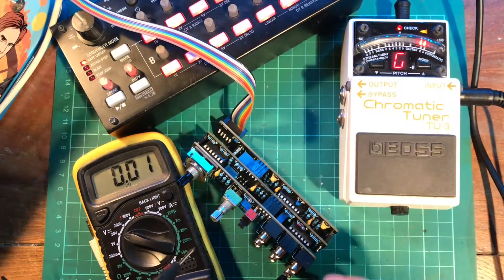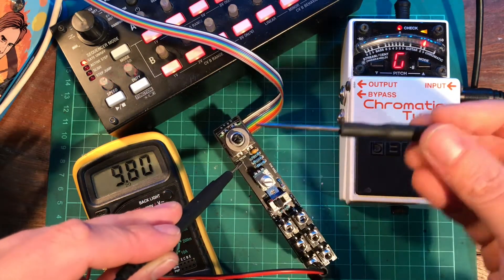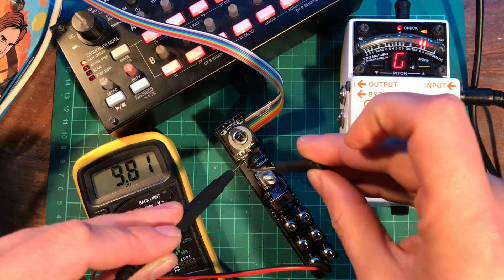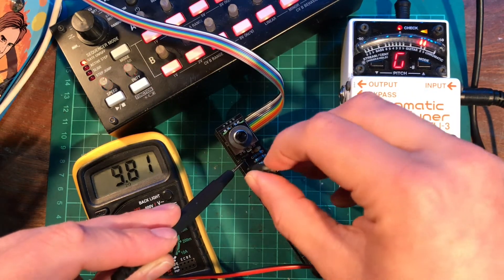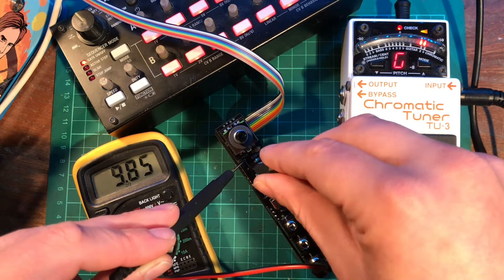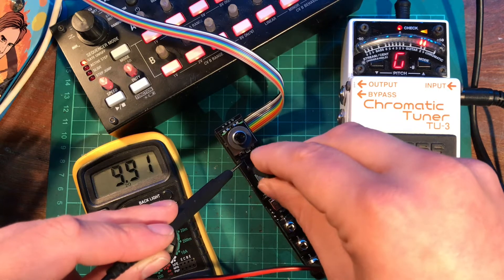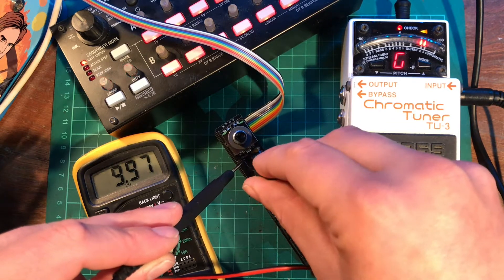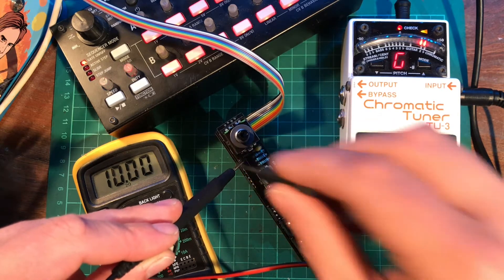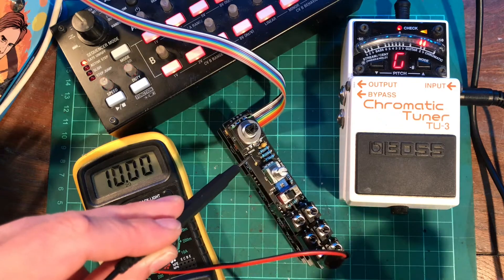Don't be confused by the colour of my cables — I'm using the red one for ground and the black one for positive. I've got the voltage set to 20 volts here because we're looking for 10 volts, so you need to have it in that right range. Put the probe on that 10 volt point — we're at 9.8 already, pretty close. Insert the screwdriver into the trimmer and adjust it clockwise to go up, anti-clockwise to go down, until you get it stable on 10. Perfect, and that's it.